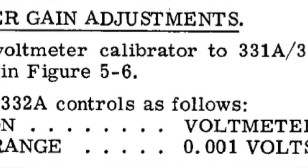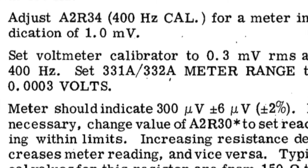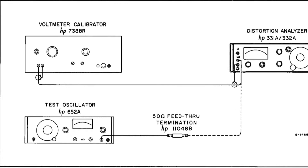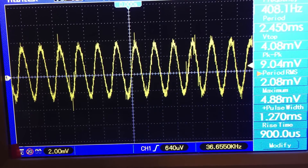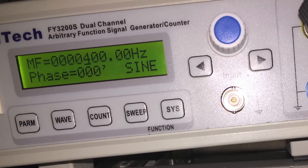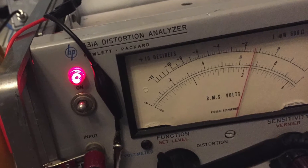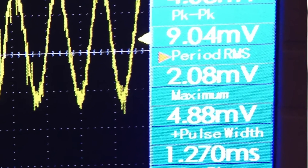The next order of business was calibrating the voltmeter to the 400 hertz reference. I used the diagram provided to set up my test equipment to closely match HP's as much as possible. I don't have a voltmeter calibrator, but I do have an oscilloscope that I was able to put in line. The oscilloscope would change the values of the signal somewhat as it loaded down; however, because I was able to get an RMS voltage reading from the oscilloscope, the voltage settings on the test oscillator were simply set to get the desired values into the distortion analyzer.